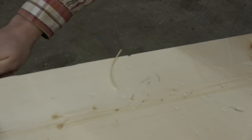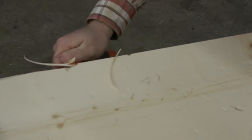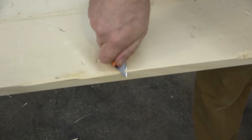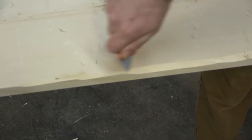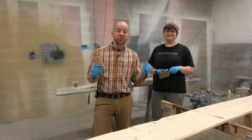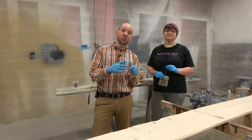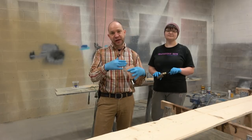It's not as exciting as the chain flail, but with the razor blade I'm going to carve on the edges some to make them less square and regular, so that when we put our caulk on our faux chinking it'll make the board look more irregularly shaped — like it actually came off of a log and not a piece of 1 by 12. Now comes the stain; we're going to flood this all with stain. All the little cuts and trauma scars we just made have exposed little bits of end grain, and once we put the stain over there it's going to show a lot more contrast as that end grain sucks up more stain.